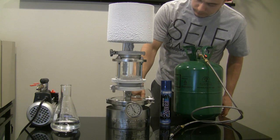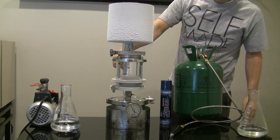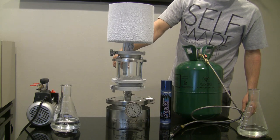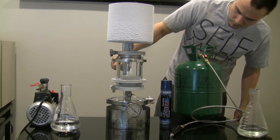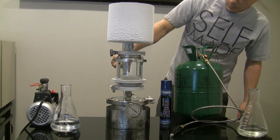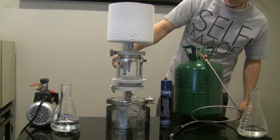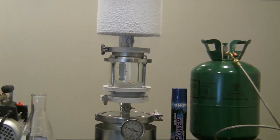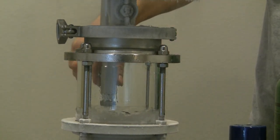Start with adding my hot water here. And I'm going to open up the back valve. As you can see, it's recovering pretty fast now. I'm going to move and zoom this in so you can watch it. What you're seeing is the butane recovering thermally with no pumps.